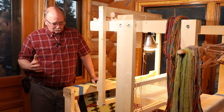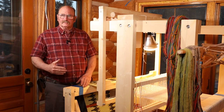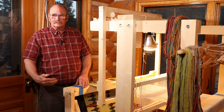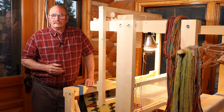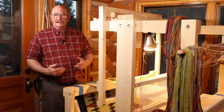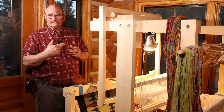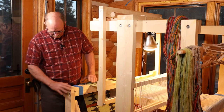After thinking about it for a little while, we figured out one of the best things to do was to put some sort of nut inside these horizontal pieces so the bolts weren't going into end grain anymore. We were able to find some dowel nuts — those drill in across the grain and provide a way to put a regular threaded bolt in. So these now have regular threaded bolts and dowel nuts, and that made this really very solid.